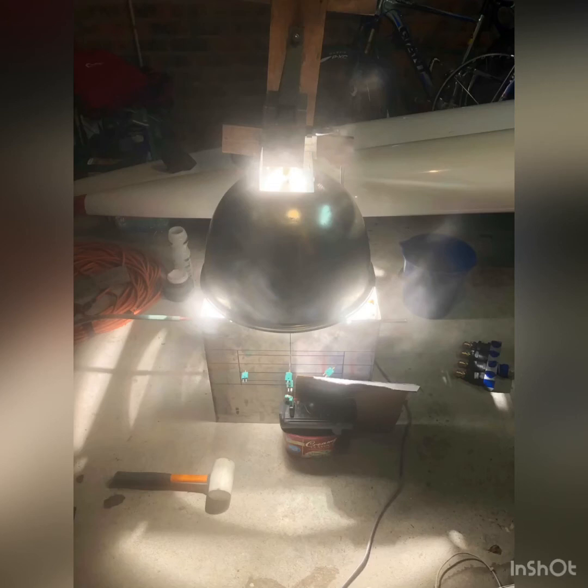There were a couple of consequences of COVID. One was that experiments could not take place at CSIRO, so to fix this problem a two-kilowatt lamp from the university was used at home to simulate the concentrated sunlight. It was nowhere near as powerful as the concentrated sunlight, so the block could not be heated quite as much, but it could still be used to validate the model and perform experiments. Another problem was that because of the depopulation of campus the MGA block could not be manufactured in time, so a graphite block was used in its place. This meant the latent heat phase could not be investigated experimentally, but graphite has similar thermal properties to MGA, so this was ideal.